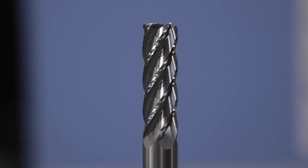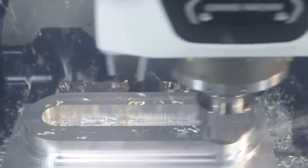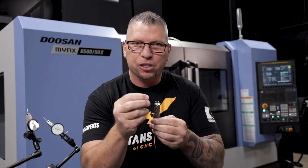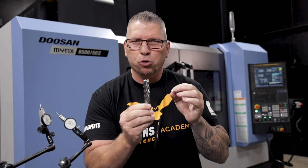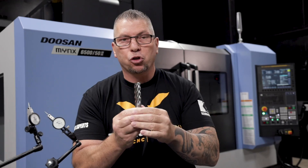What about soft materials? It's the Core 5 — the king of roughing. It's got five flutes for using the same trochoidal milling techniques, just like the Harvey 3, but it's in aluminum. It's got little chip breakers in it, so the chips come off small, and this thing gets after it. You can see videos where I'm actually pushing a half-inch Core 5 getting 180 cubic inches per minute. These three tools — we stock them — and they allow us to aggressively mill everything.